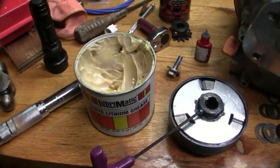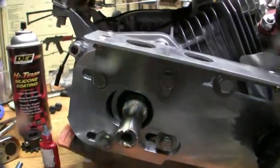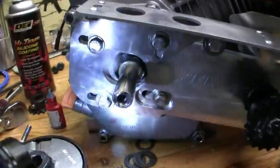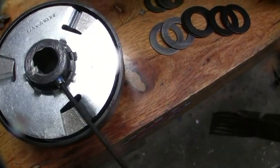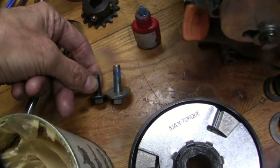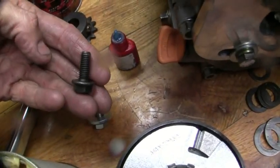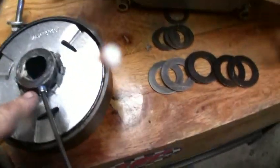I'm putting the sprockets on this cover and these crankcase cover bolts. I torqued them to 18 pounds right here. These are torqued to 18 pounds and also this one in the middle here is torqued to 18 pounds. Now these are overkill — they're a fine thread quarter inch, and this one is also longer than the one they give you. I use a longer one because it goes in further and holds better, and it's stainless steel. The stock one isn't stainless steel so it's going to rust. I use stainless steel and you can see there's loctite on them.